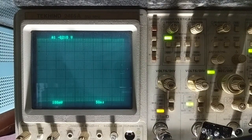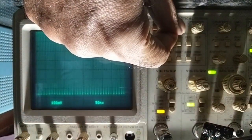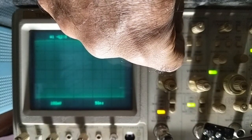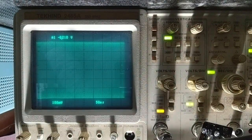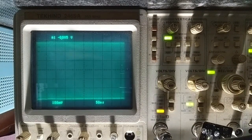Going up to 100 MHz, you can see that the amplitude is now approximately 6.6 divisions. At 200 MHz it is down to about 6.1 divisions. Now bumping up the frequency to about 300 MHz, the amplitude is again about 6.2 divisions. How does the RU400 compare with this performance? Let us take a look.